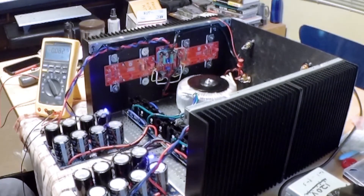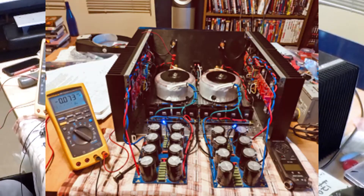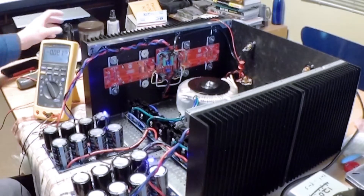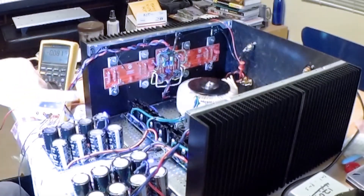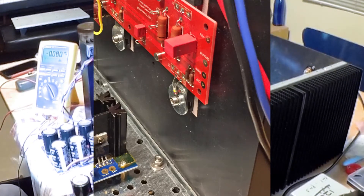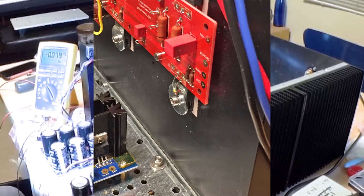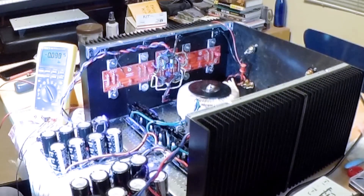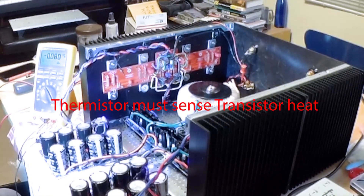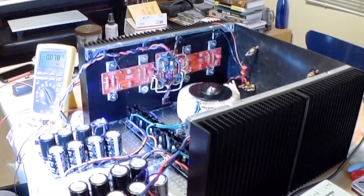Before I do any bias tests, I will need to get bigger fuses, because I am sure those 2 amp fuses will pop the minute I try to crank the bias up. Also, the thermistors — I do not know if you can see them, but there is one right there. I have got them bent and they are more or less making contact with that big washer. I am probably going to have to figure out some way to glue them down, possibly with silicone seal and a piece of tape, so they are in close intimate contact with that washer.